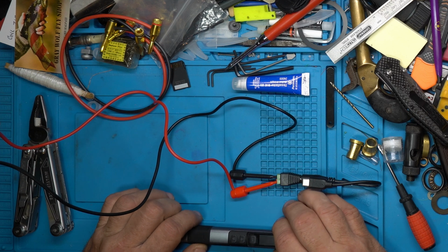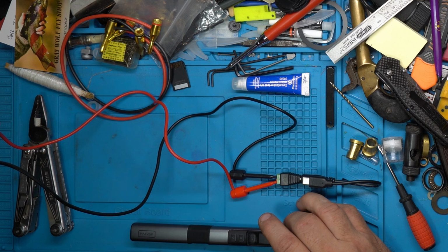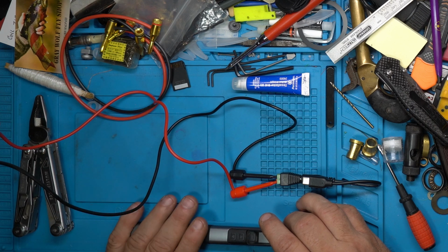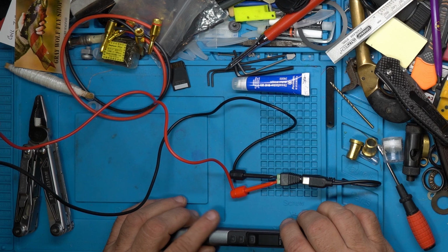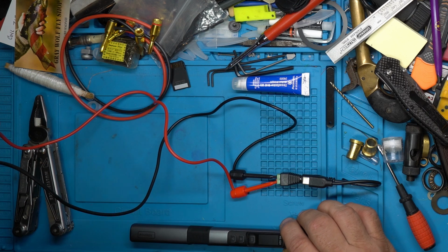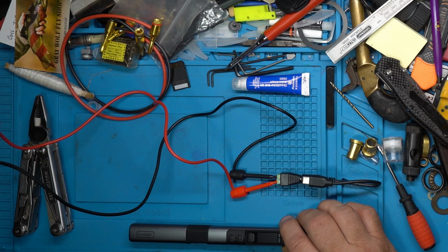So I think it's the smart aleck power supply getting in the way more than it is the iron itself. So I've got a lot more respect for the iron, and how they designed the firmware inside the iron. So let me turn the channel off. I'm going to set my current back to 3 amps, and I'm going to set my over current protection at 3.30 amps, which is where it's normally set.